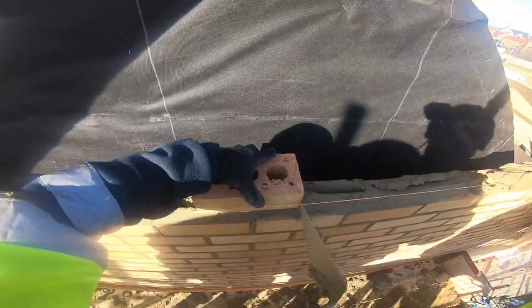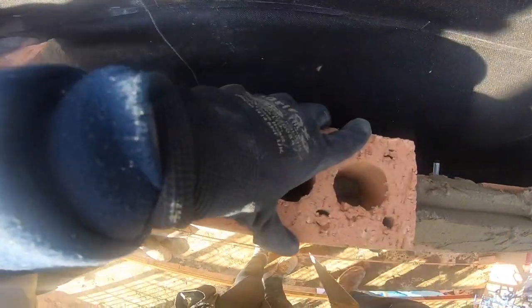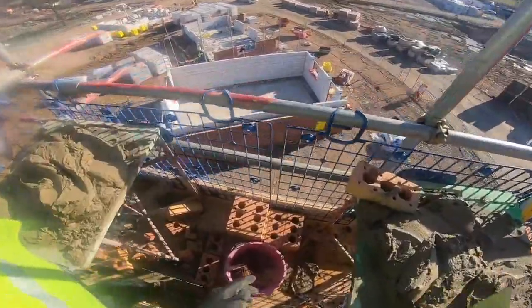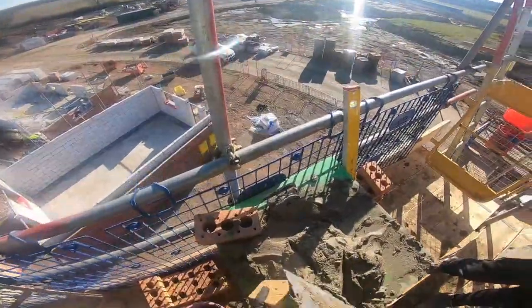Right, so when you're putting a brick in the wall, the first thing you're doing is ironing up. To make sure, I like to go down just to make sure. I haven't got that hand strength yet, so I just give it a little tap and it just falls into place. And then you get your trowel at this angle and just take away the excess. Then boom! Boom! Pick up the other brick, pick up some muck and...